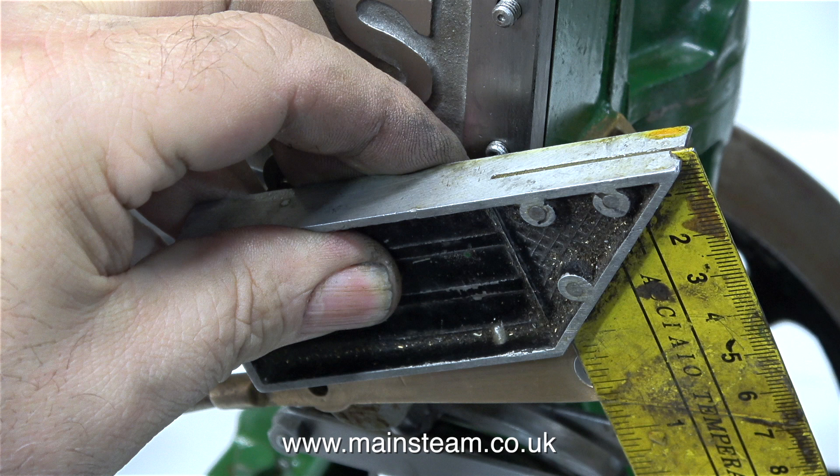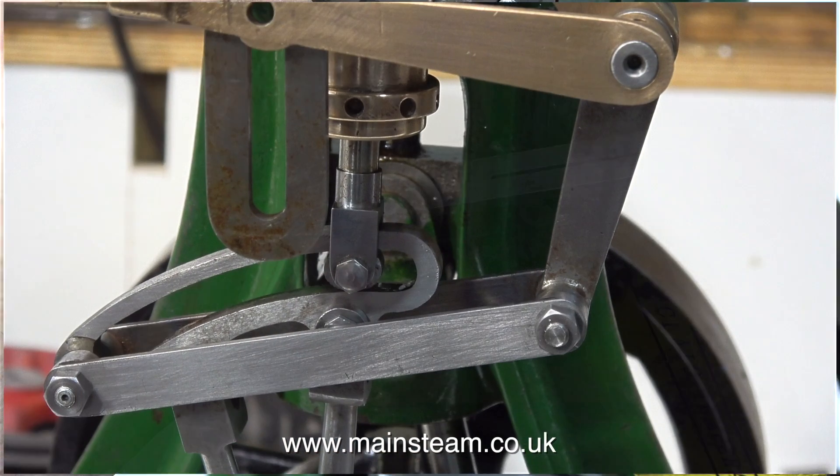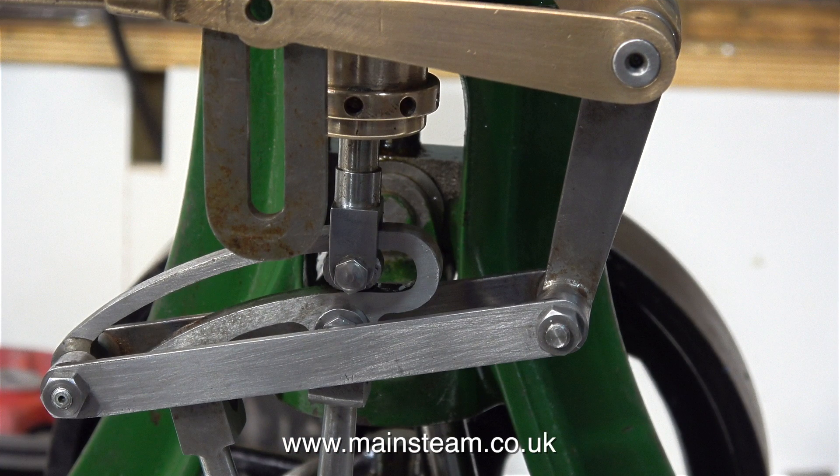So why were the two holes in the original brass shaft? The problem is it's logical to set this arm at 90 degrees, but that's not always right — it needs to be set to the position of the valve gear. The movement of the arm is limited by the quadrant, so a few test runs are in order, just to make sure that when you move the arm in the quadrant, the two pins I've made need to line up perfectly with the pin that's in the valve fork. If you get this wrong the valve gear will not work properly.